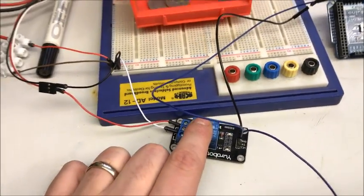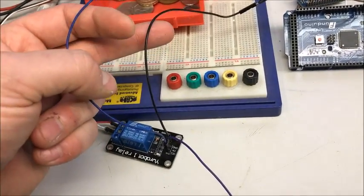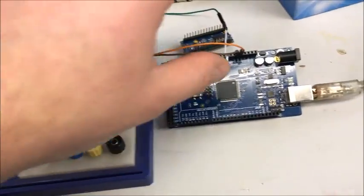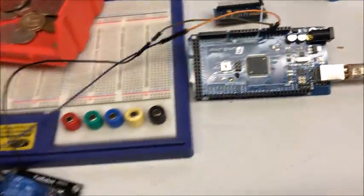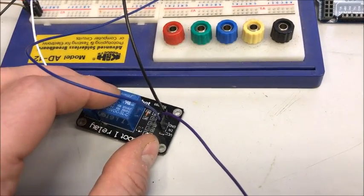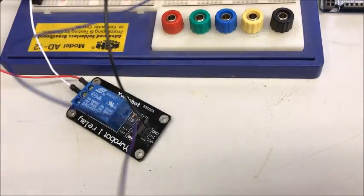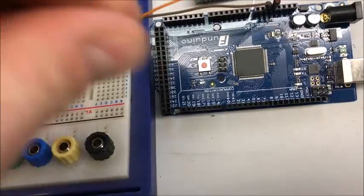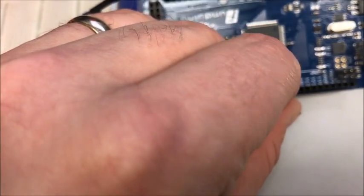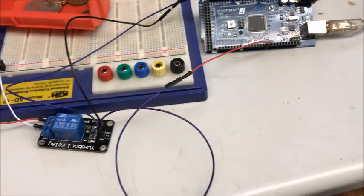Basically all we're doing is looping that live from the 12-volt supply through to the hopper — it's a relay acting as a switch. That's how we're going to power the hopper. Now we need to power this side of it: 5 volts going to the Arduino, so we've got 5V and ground going to VCC and ground respectively. The relay input goes to pin 7 on the Arduino — you could change this in the code, but I've set it as pin 7.